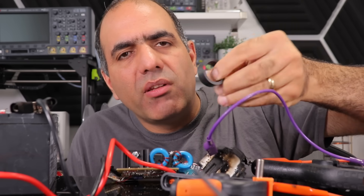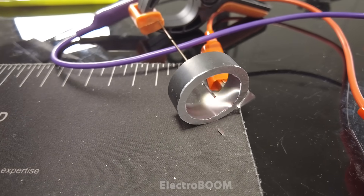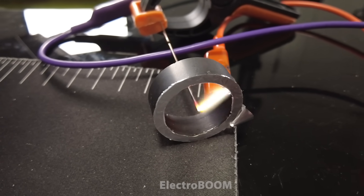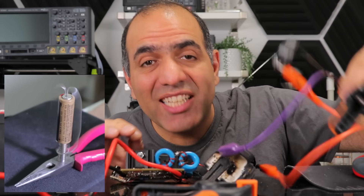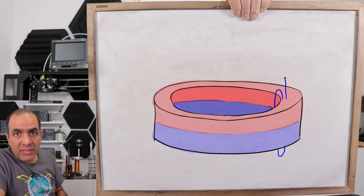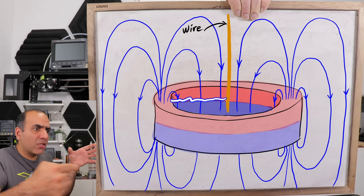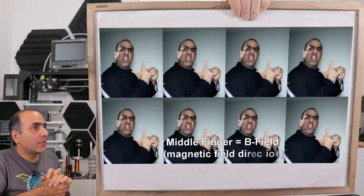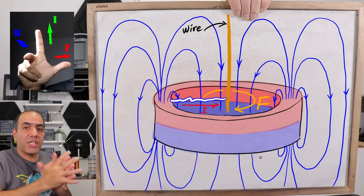This is not conductive at all. Let me stick some aluminum to its surface. The reason the arc turns is exactly the same as why a homopolar motor turns, which I explained in my old video — go watch it. Basically, for a magnet like this, the magnetic fields all flow in the same direction in the middle. With a DC arc, the current runs almost perpendicular to the fields. Now if you remember from the right-hand rule song, there is a force always perpendicular to the arc that keeps pushing it around in a circle.